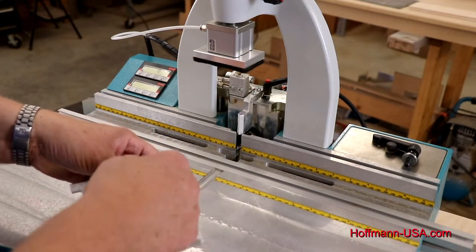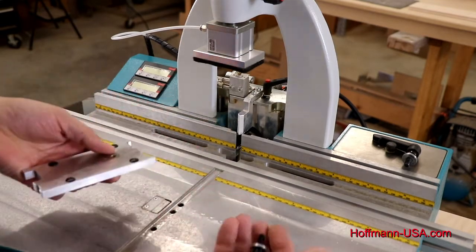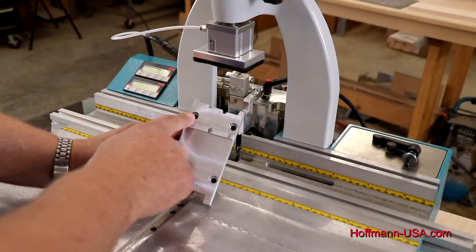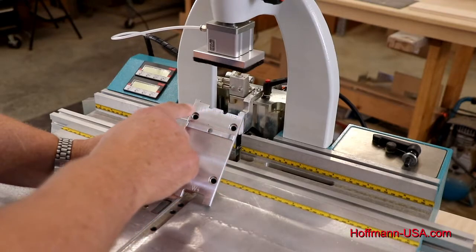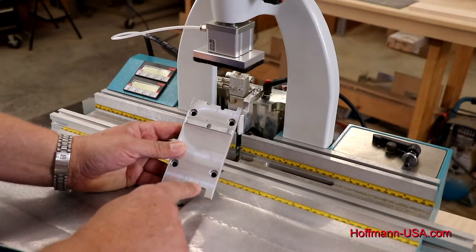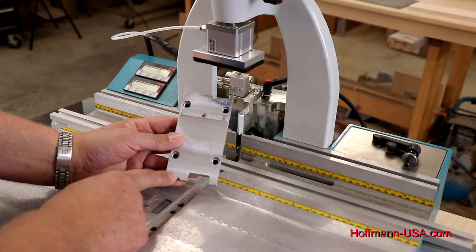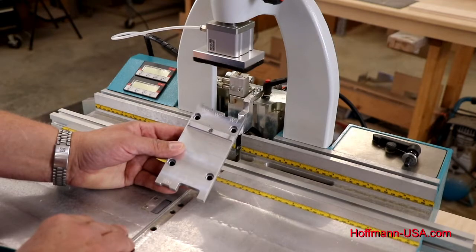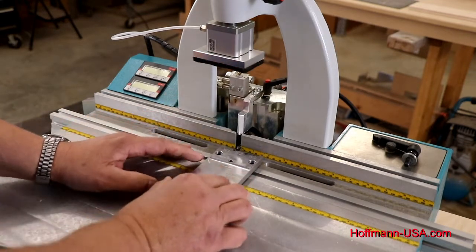Take the handle out and the little square nut, and when you turn it over you'll see that the different machine steps are marked W1, W2, W3, W4, and here's the smallest one, the W0. Since we changed to a W1 router bit we will use the W1 step.